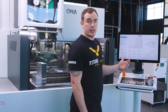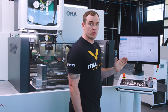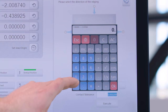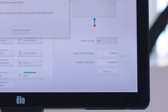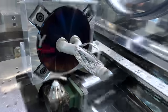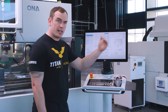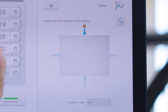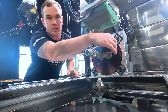Now we're done with our X location. We want to find in the Y positive direction, so we're going to come down here and select that icon, and that's going to move our wire in Y positive. After that, we're going to set our tolerance a little tighter — we want it to hold 1,000th of an inch accuracy. We're going to type that in and then we're ready to hit execute. Our wire is moving closer towards our edge, and it's going to touch that edge a few times and give us the exact location of that position. Now that we've found our Y location in the positive direction, we're going to select this icon and that's going to find our Y position in the negative direction on the other side of our part. We're going to come around our part and find this edge right here.